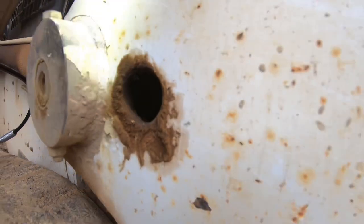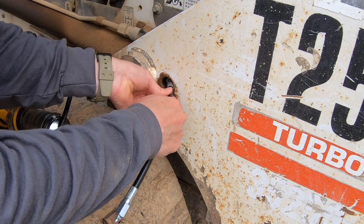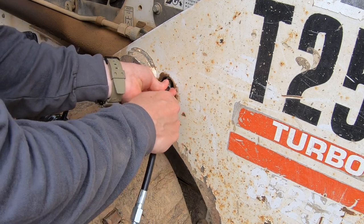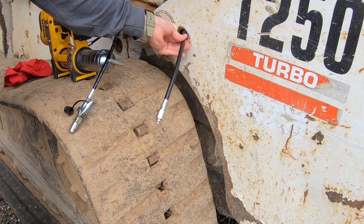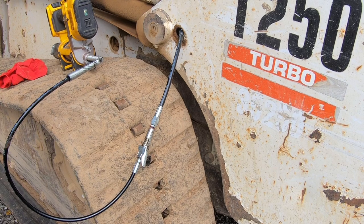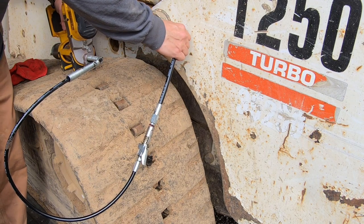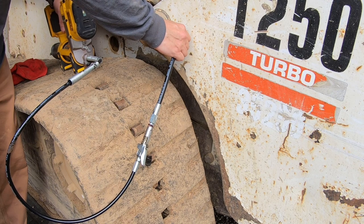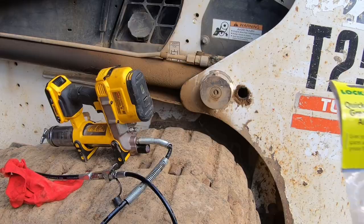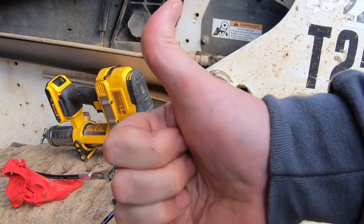Let's check out the flex hose. I'm going to loosen it about a half turn and then connect it by feel — it's locked on. I'll go just a little tighter because I don't want it leaking everywhere. With our flex hose attached to that fitting, we're now going to put our Lock and Lube on the end of the hose. So we've got the hose on, Lock and Lube connector on, grease gun on. I'm going to hang on to that and start greasing. Grease is starting to flow out — so we're getting it in there. It's a difficult fitting to reach, but the Lock and Lube quick connect grease hose adapter made it happen.